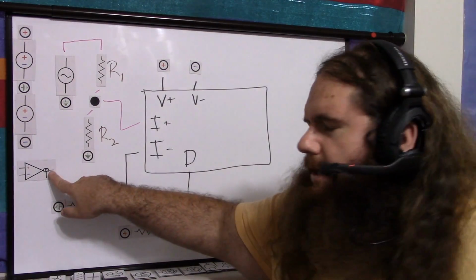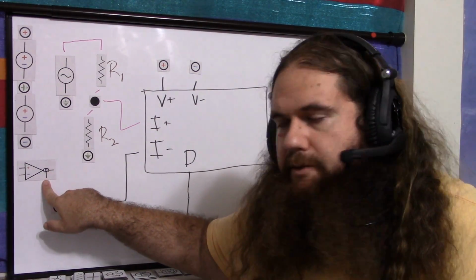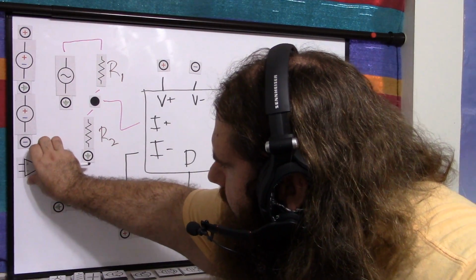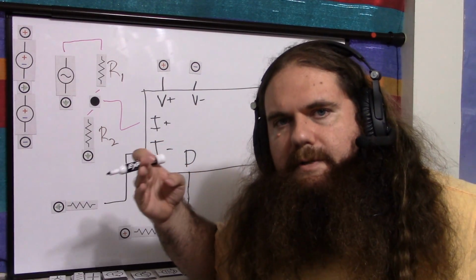Nice and easy. So then you need your IABC, your amplifier bias current. This is the current that controls the gain, the actual input that is important enough for me to draw a line right here. Looking on the data sheet again, it says an absolute maximum rating of 2 milliamps, and keeping your maximum at 1 milliamp is pretty good.